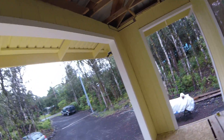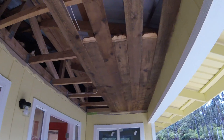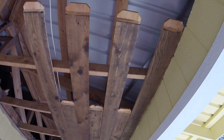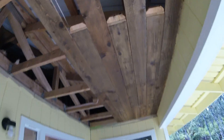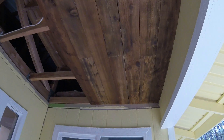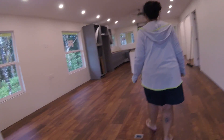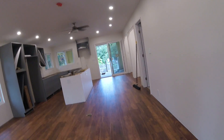We have some news here. The paint is all done, and we have some test sealing up. This is actually cedar fence pickets that have been cut — they normally have these little ends, but I cut those off on a 45-degree angle and then scarfed them together. They're stained with some deep walnut stain. She's saying 'oh my God' because she has not seen the floor. They're so good — this is our flooring.